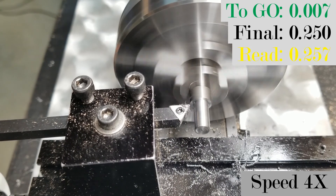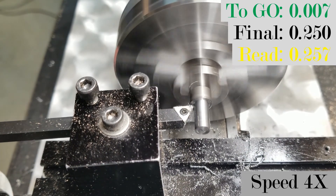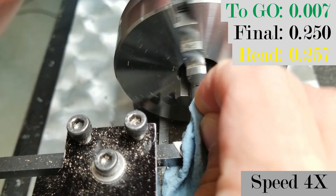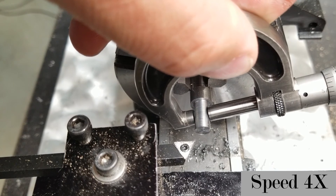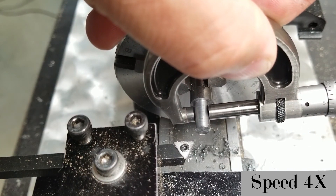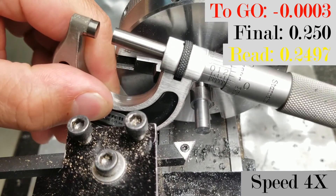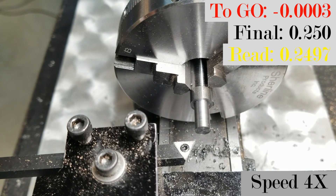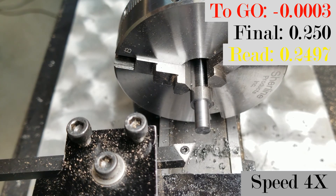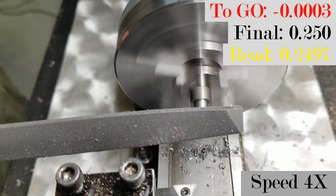I think I went in a little too far — touching off should not remove that much. But this high speed steel is amazing, it just takes it right off. I took my pressure cut and not much came off. I'm a little under by three ten-thousandths, so I had run my cutter in one touching off a little bit too close. I want to see how that turns out — I would have to polish it with emery cloth to make sure it fits the bearings. I want to file the end of it heavily so those bearings could slip on a little cleaner. There's plenty of shank left and I want a nice taper to slide those bearings on.